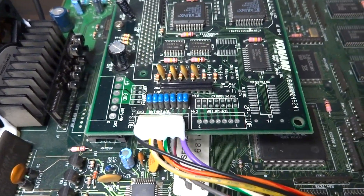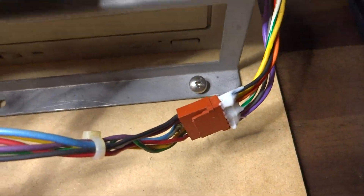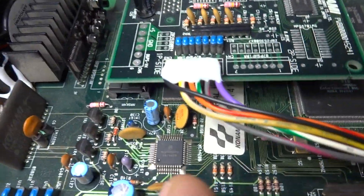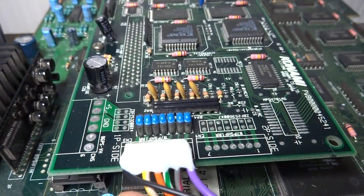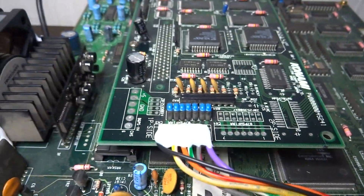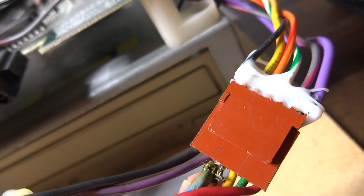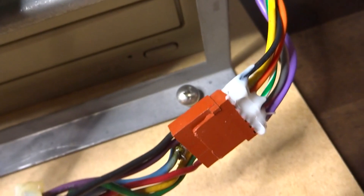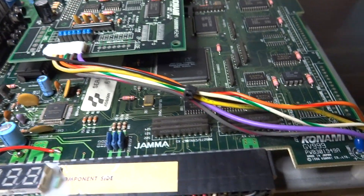Some other things I've done here: this is the original pinout for the trackball, but to make it work with HAP controls I've changed this around a little bit. It's essentially the same thing, but Konami decided to use seven pins on one connector and six on the other. What they've done is basically added another ground, so you can't just plug in regular HAP controls to it.